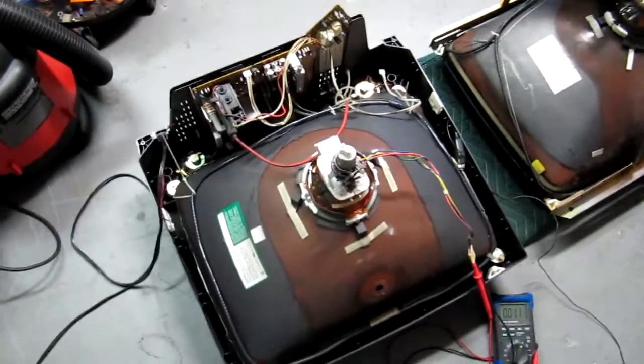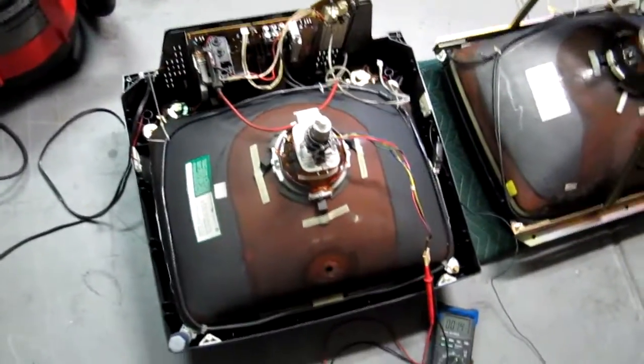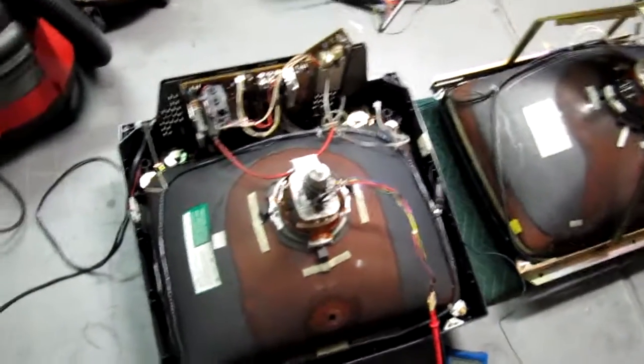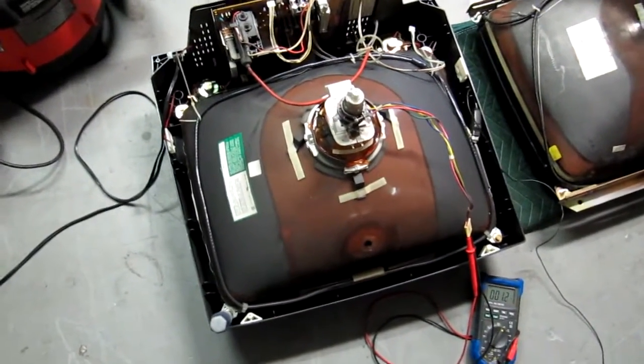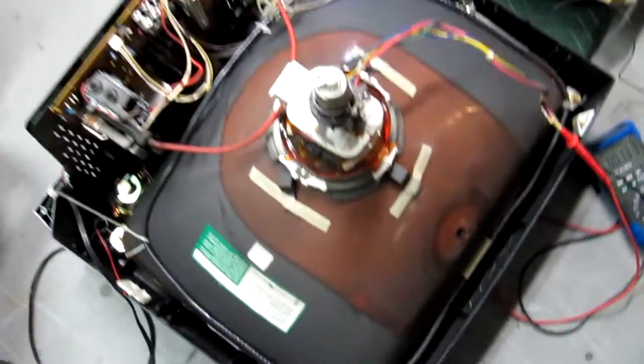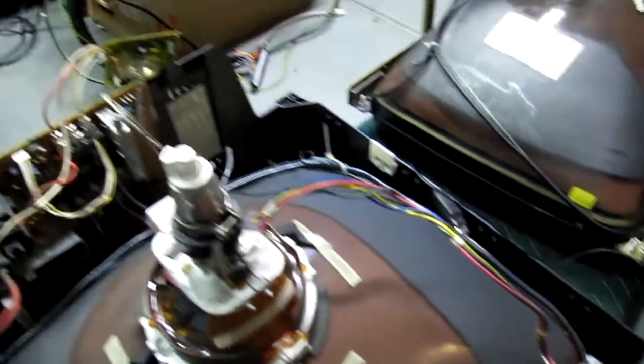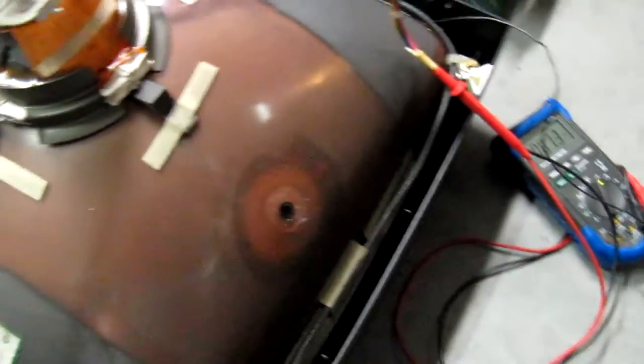Here's the TV and the monitor placed face down on the moving blanket. I've taken off the back of the case — there are five Phillips screws: four in each corner and one in the middle near the coax section, which holds the board in place. I've taken off the yoke board since that isn't really needed. The flyback anode cap — first of course I discharged it, because I had been testing this TV so it held a charge. If you haven't fired it up in months you shouldn't have to worry, but I had just turned it on earlier so I had to discharge it.